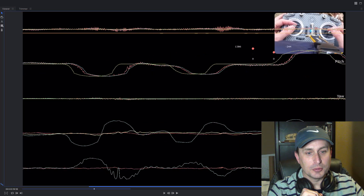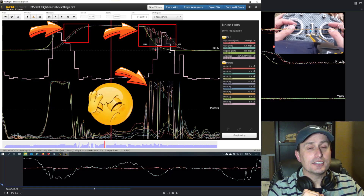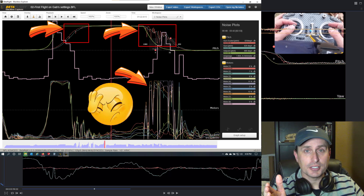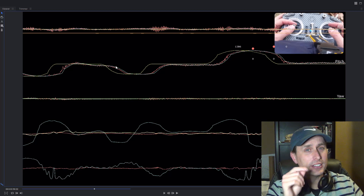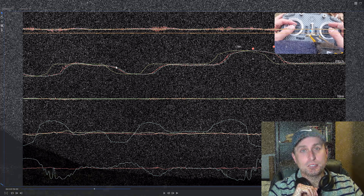As I'm doing other pitch moves and looking up at the gyro signal, you can see these jerks and juts. That is an indicator to me that there is an issue on the pitch axis for this flight control board — either an electrical issue, or the MEMS and the gyro itself. We'll take a closer look at that later. That's the kind of stuff you need to be looking for, and a good reason to always log your flights to make sure everything is working right.